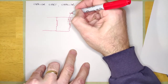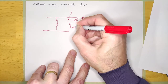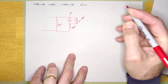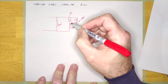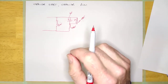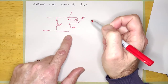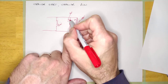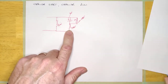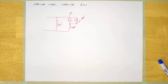What's going to happen is it's going to start up with both capacitors in there, and that will be optimized so this thing starts up with the maximum amount of torque. Then the centrifugal switch is going to open at some point and take out the start cap, leaving just the run winding and the run capacitor. This is the run cap, and this is the start cap. This is the start winding, and this is the run winding.